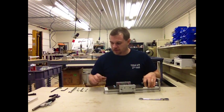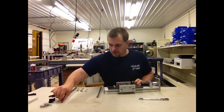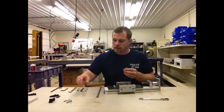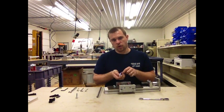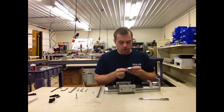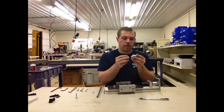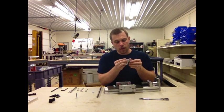Installing the lead screw is a two-step process. The first thing we're going to do is take the low profile bearing block — we're going to need two 1¼ inch carriage bolts and two 5/16 inch lock nuts. We're going to put the 1¼ inch carriage bolts through the bottom, and then the lock nuts are going to rest in the square slot cutouts on the low profile bearing block.